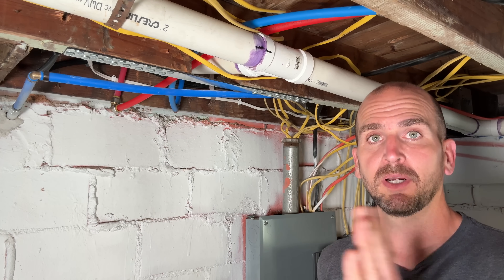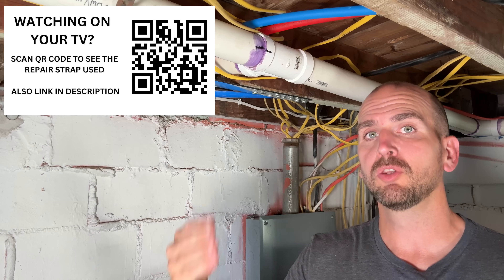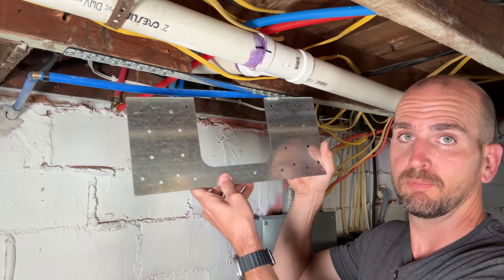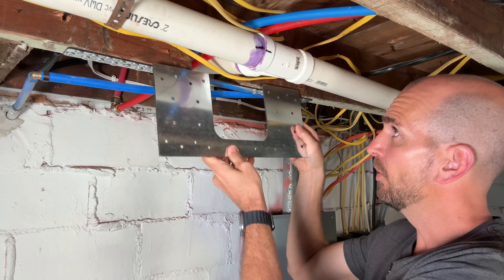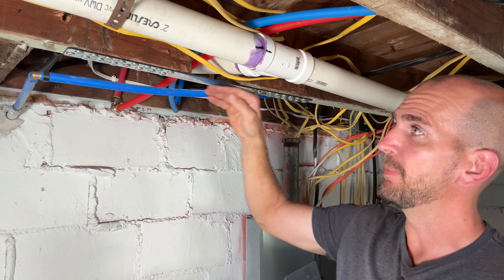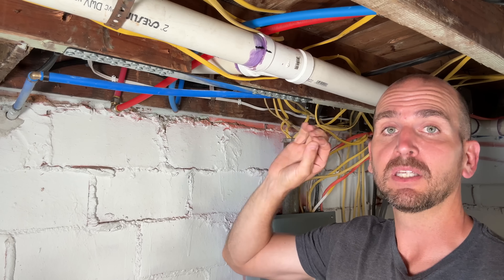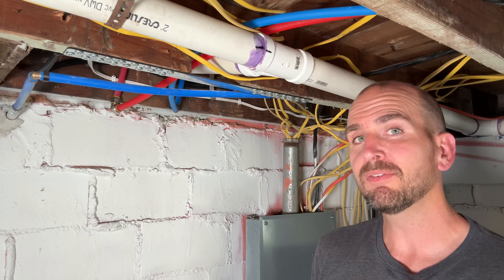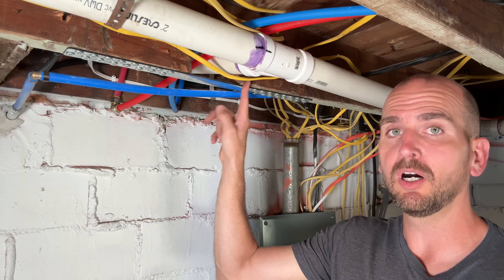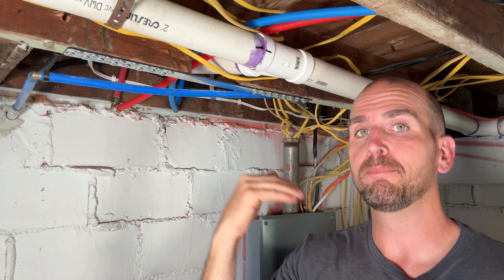At joistrepair.com — you'll see that link in the description or via the QR code — you can look at the different varieties they have. They also have side plates, which are more common, and those go up into your floor joist keeping the bottom surface clear, with additional strapping at the top to give you structure. So even if you have large holes that have compromised the structure of your floor joist, these plates can get you back to above what the original floor joist was providing.